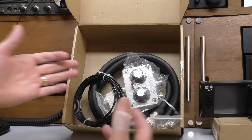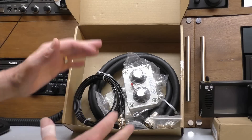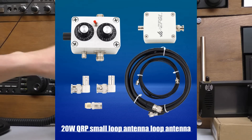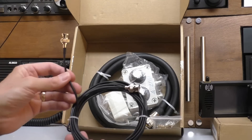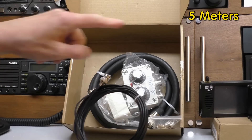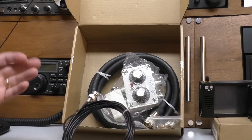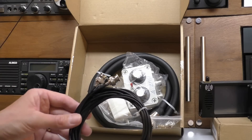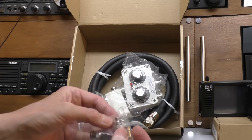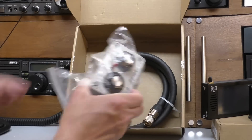There's a switch and it would have made things a little bit easier. I've never owned a loop antenna before — it does look fairly basic how it goes together, but I do feel a simple instruction sheet would have been a good thing. In fairness, they have tried to supply you with everything to get you started straight out of the box. You have a coil of RG174 coaxial cable with two female BNC plugs — I'll put the length on screen when I've unrolled it later. For transmitting I'll be replacing this with RG58. There are also two right-angle elbow female-to-male BNC adapters and a male BNC to female SMA adapter.